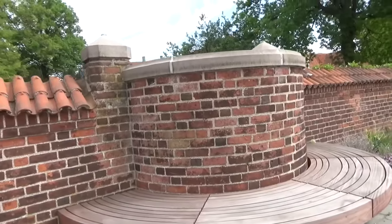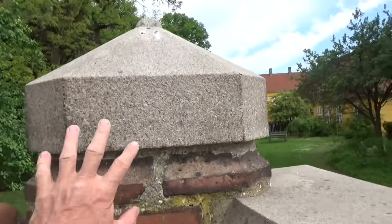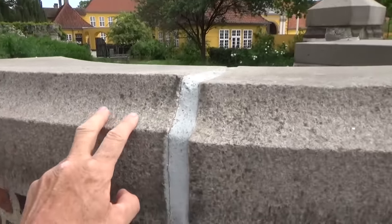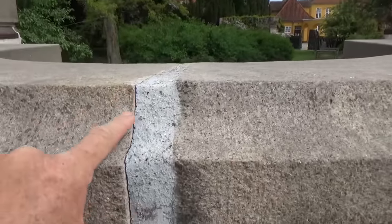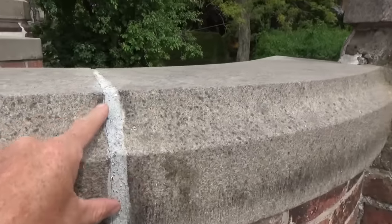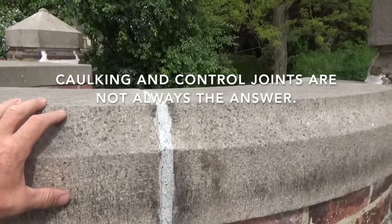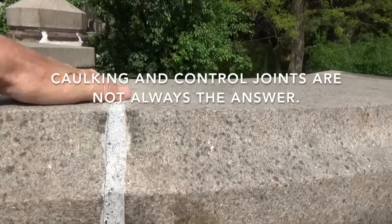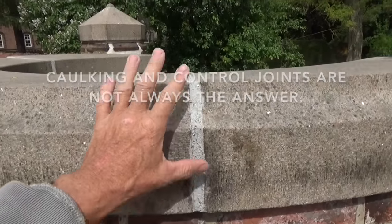Here's a little offshoot of that wall and they put a granite top on it. That covers everything. But when you put these little granite tops on like this, you're always going to see a little crack here, because this expands and contracts with the weather. You're always going to get water in here no matter what. All that caulking and everything is a big joke in my view — it's only temporary.